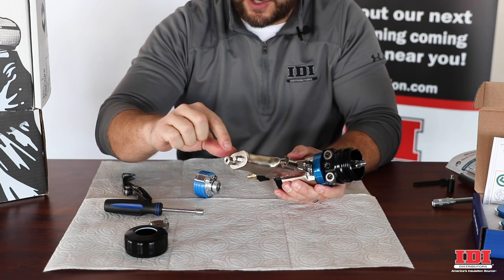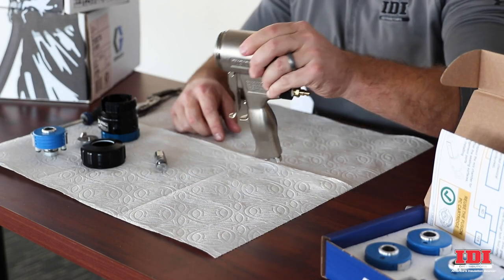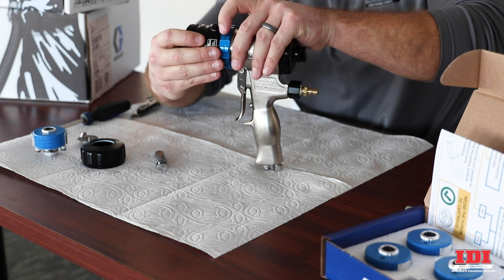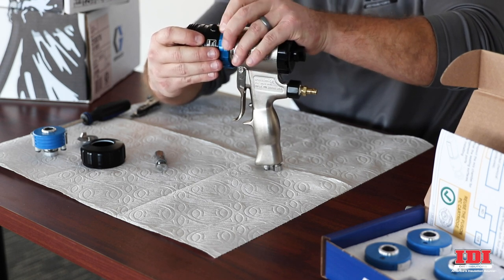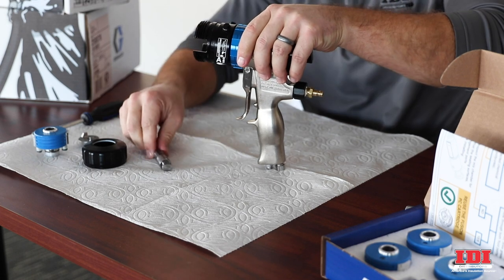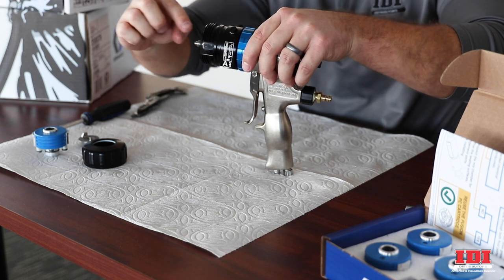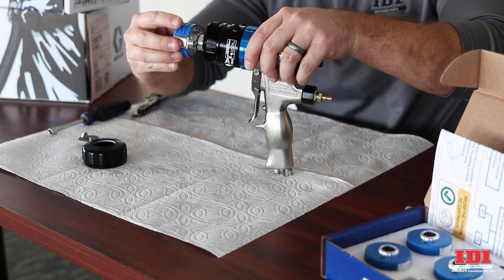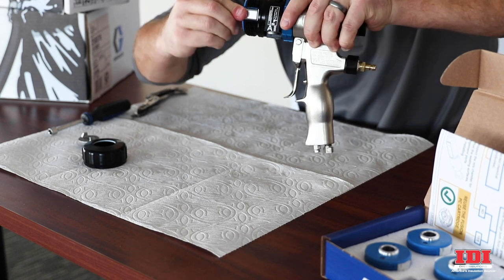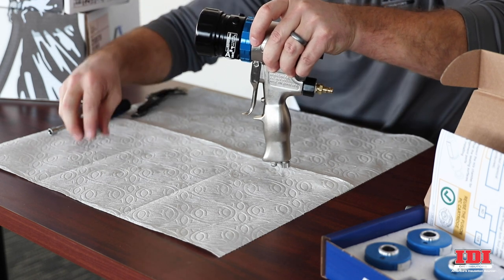When you buy this retrofit kit, it comes with this new housing and this new tool. For reassembly: take your old handle and thread on your brand new retrofit kit. Then the mix chamber — note the nomenclature on top. Then the disposable cartridge, and again we're looking for that resistance as the side seals ramp up onto the mix chamber. Then the retaining ring, and the air cap.